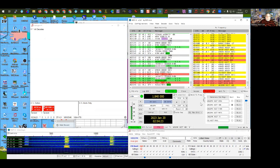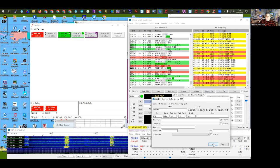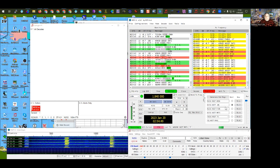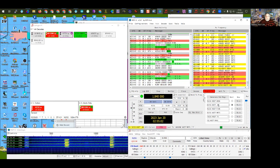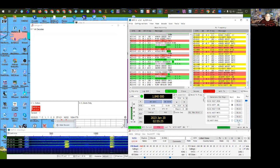If I leave my radio on 160 overnight, it will continue to decode and send spots to PSK Reporter even while I'm asleep. Two stations answered my CQ — because I have it set to Maximum Distance it answered WB1 first rather than the other. I'll finish that QSO, then double-click on the second station for the next sequence. I got my 73 from WB1DMK and sent minus 6 to N2SG — we'll see if he responds.